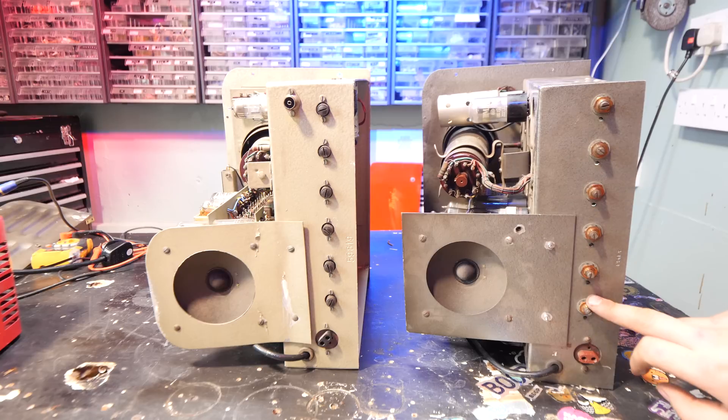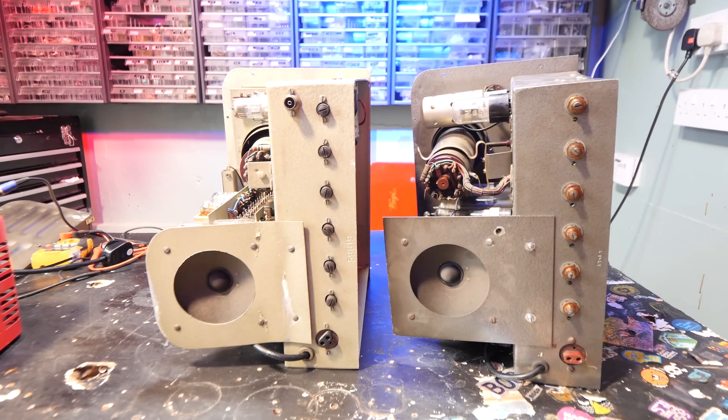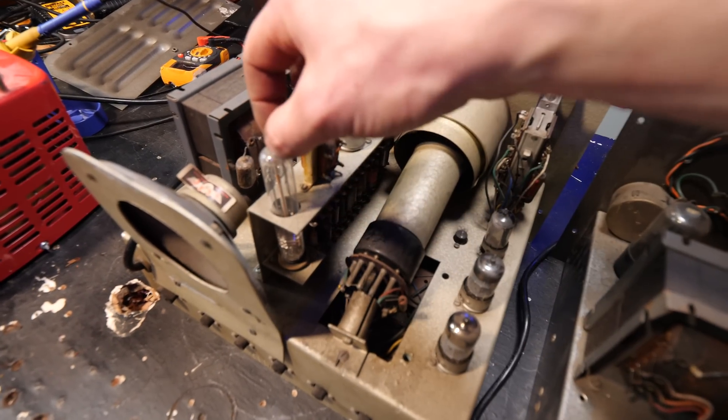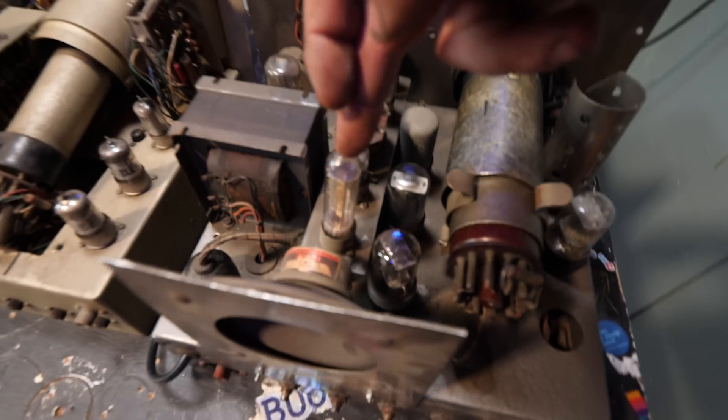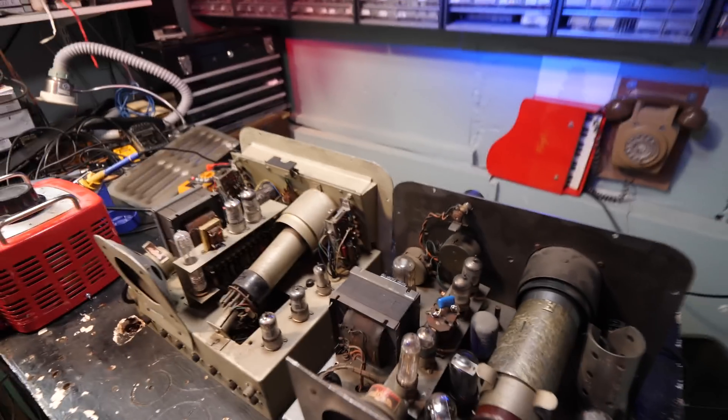I think it's up, down, left, right, plus focus and intensity. On the top it's the same story — very similar but slightly different. There's a secondary circuit that's right here, very similar. It's got one less valve than on this one, though there are a couple of different valves sitting around in different places. The quartz one is lower mounted, so it seems to have a bit more stability — this one is just in a socket itself, maybe there were problems. The CRT tube is mounted slightly differently: it's slightly high up here, whereas on this one you actually have a back rest for it, so maybe this was problematic.